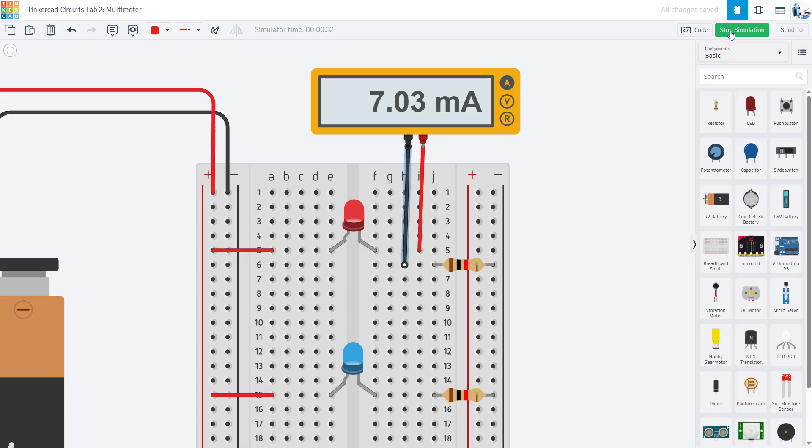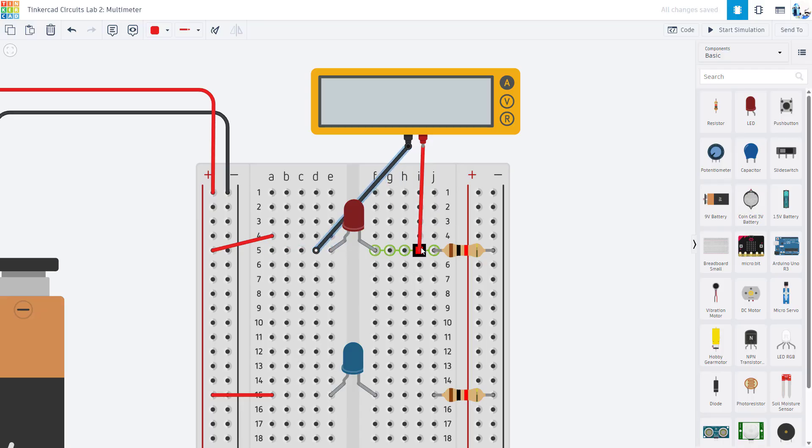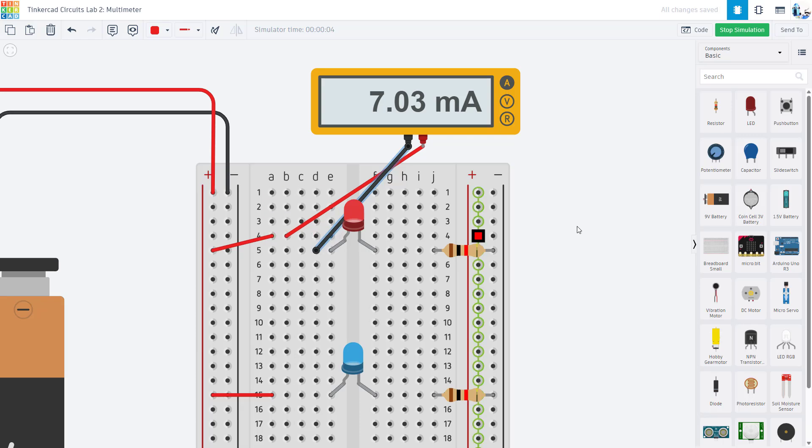In order to do that, I had to rearrange the circuit — move the resistor so I initially had an open circuit with no current flowing, then insert the multimeter in series between the LED and the resistor to get the current measurement. Since current is the same in series, I could do this anywhere in the loop. For example, I can move the jumper wire and put my multimeter leads on the other side of the LED and get the same current reading.